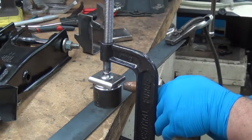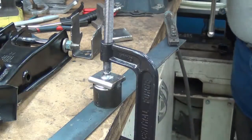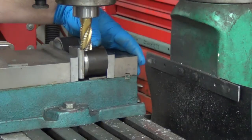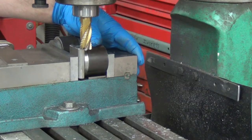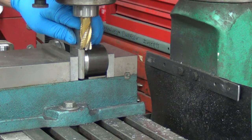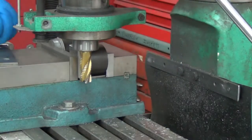I've got to drill and tap a hole. That'll probably hold — if not, I'll just weld it again. Basically what I'm doing here is I need to machine the sides flat. I put a parallel underneath to keep it parallel this way, but then it rotates like this. I can either put a parallel on here and eyeball it on the front, and probably get it just as close as if I run the end mill down and eyeball it against that.